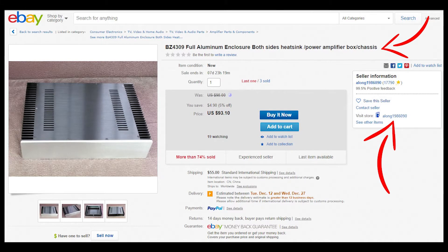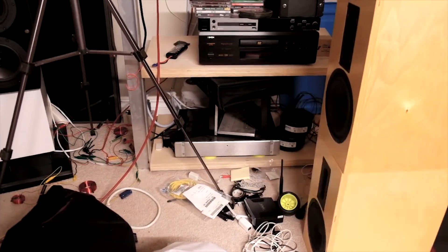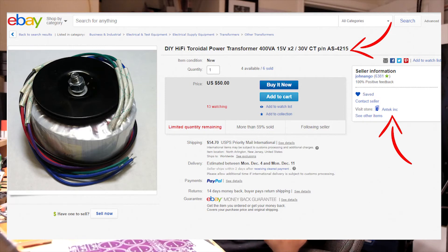To build this whole amplifier, it's not a lot of money. The only thing that costs a little more, if you're picky like me, is the case — I like fancy cases. The case I have down there cost me $80, works great. There are two Elf Minis in there, one on each side. For you guys in the States it's $80 shipped in American, or about $125 Canadian for the chassis shipped. I'll find a link for the transformer and put it in the video description. You don't want to go anything over 20 volt rails — they were never designed for that. 20 volt rails will give you 30 watts RMS Class A.